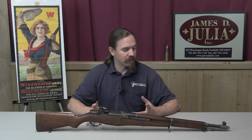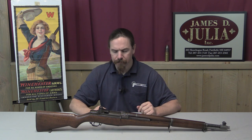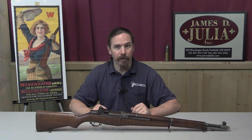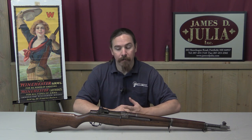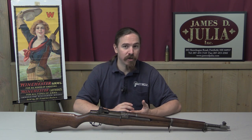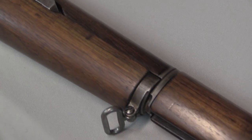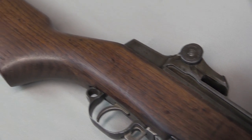The story starts with John Garand's original design. He had avoided drilling a hole in the barrel — he didn't have a gas port. This was not that uncommon of a practice in the 1920s and 1930s. People suspected that a gas port would lead to erosion of the rifling, cause accuracy problems, and that the gas port would expand over time, so your rifle wouldn't have a very long service life. Now it turns out most of these problems have turned out to be non-issues, but they didn't necessarily know that in the early 1930s when Garand was designing this rifle. The Germans also had some rifles like this, and a number of other countries experimented with it.